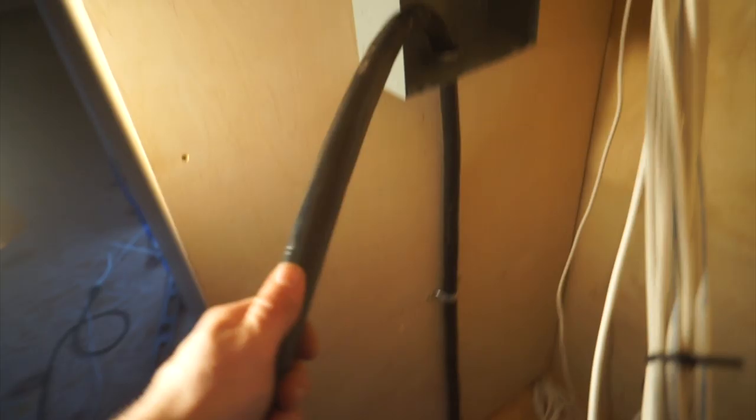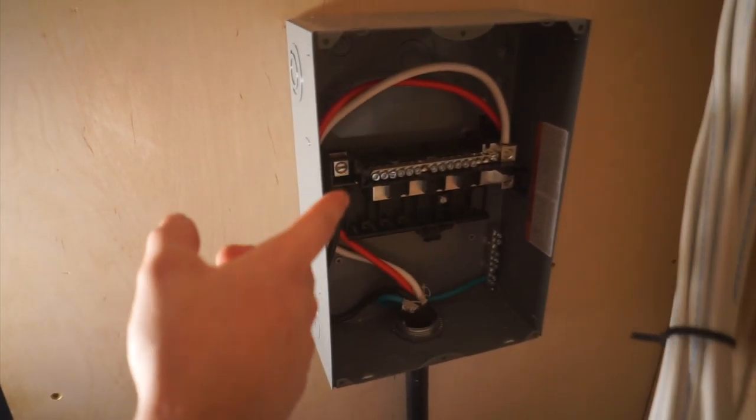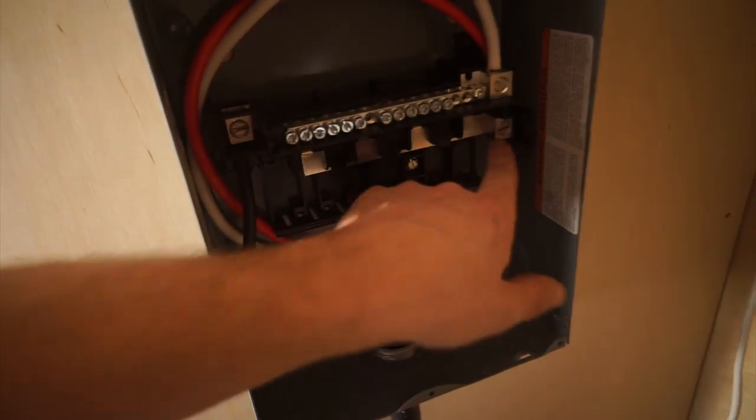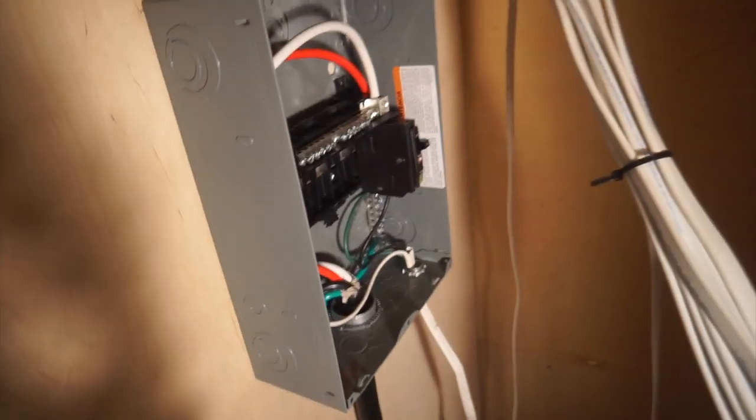I've got a big 50 amp cable in here and I'm going to stick it through into this thing and cut it down to size. I've got my big cable in the box and I'm going to wire this in. I really don't have a way to show you because this wall's right here, so I'll just take care of it and bring it right back. Main breaker box wired from the shoreline — we got two hot lines feeding 120 volts each. We've got our neutral connecting to all the neutrals coming from the lines in, and we have our ground. I've wired up one outlet using spade terminals with heat shrink. One last thing to do: wire in a breaker in the breaker box. My wire management will probably change, but I have one breaker wired in and now we get to see if it all works.